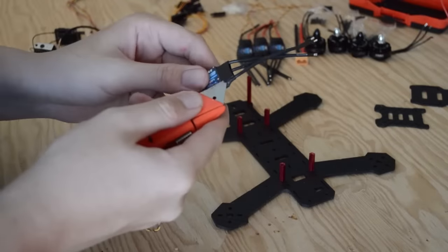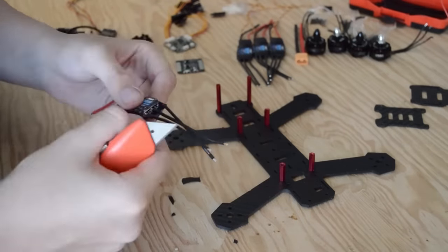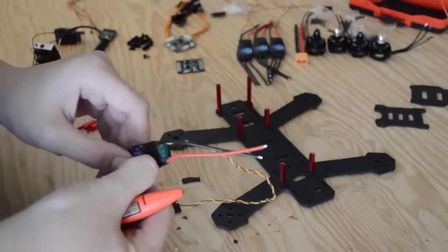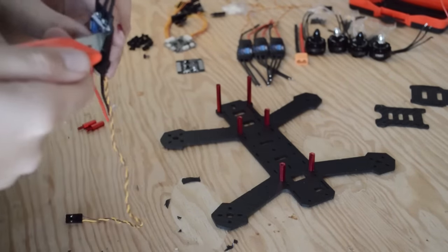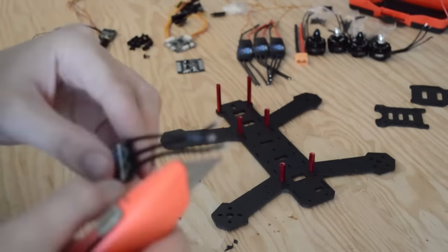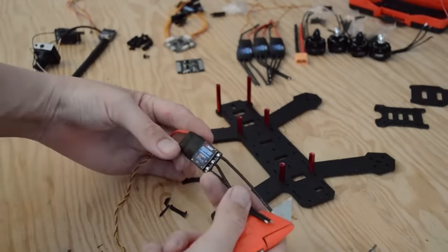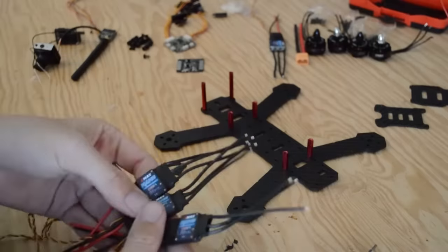This process takes a little bit of work. You don't always do this kind of prep on your ESCs. Sometimes you will completely take off the heat shrink and then apply a new heat shrink, which is recommended. But for this build, we're just going to expose the tip of our ESC leads for us to easily solder and desolder them. I'm being very careful to cut away no more than I need to. I don't want the underside of the ESC to come in contact with the carbon fiber when we put it on. If that happens, bad things will happen — electrical fire type things.